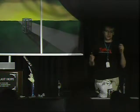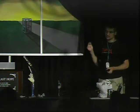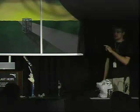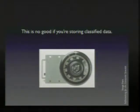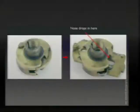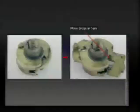You can't play with the slider, because it's spring-loaded such that when it's triggered, it snaps out of place. It doesn't move gradually, it just snaps. And the thing that caused it to snap is a little fly on the center of the dial. That is, that thing. If you take a look at this and compare this to most safe dials you've seen in movies or perhaps in person, you'll notice there's a critical difference. There's this little arrow-shaped thing in the middle of the dial which actually rotates. That thing will only rotate at that one particular place in the dial and will trigger that slider to zip out of place and lock the dial in place just enough that you can't ever reach the contact points and you can't ever get information about the wheel pack.